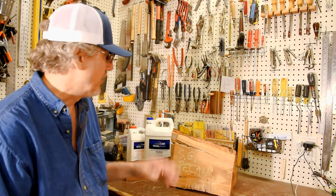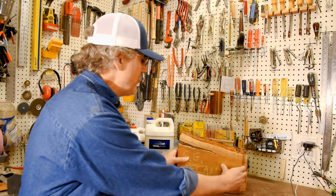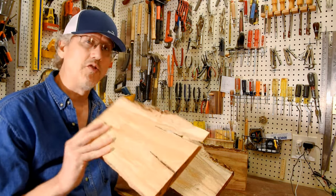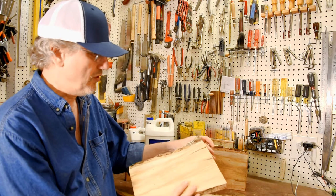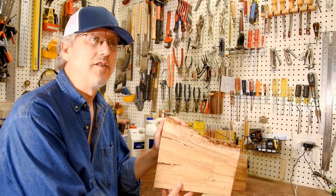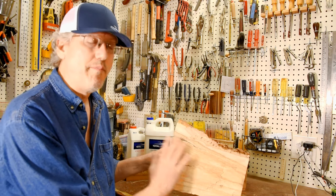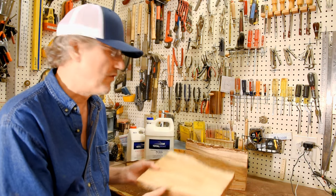For an example, I've got a log here — a piece of pecan which I took slices out of, and you can tell from the slices that there are all sorts of terrible cracks and checks. However, this wood, which is kind of a spalted pecan, is absolutely spectacular. I don't want to lose this; by filling in the crack I'll be able to accentuate those marks, make it part of the wood design, and use these boards just like any other board.